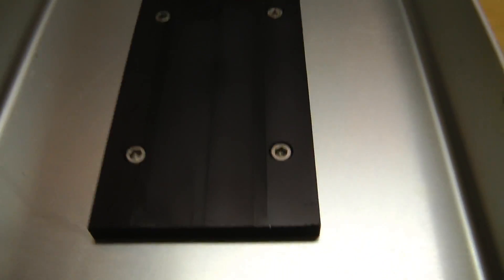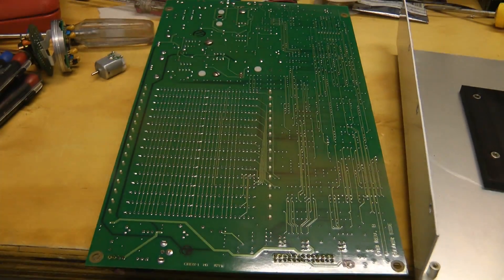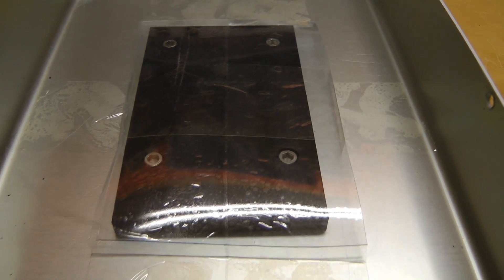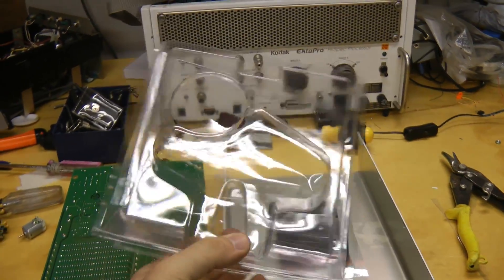I think I might have an idea of what's wrong with this. Looks like the pins on the RAM here are touching this metal piece — you can see indents all along where the pins are touching. Because this is anodized, the surface is insulating, but I think after it's contacted enough, it's actually worn little pits into it and contacted and shorted out. That could explain why the camera's not displaying any image. I'll use a bit of PET plastic from some product packaging to fix that.